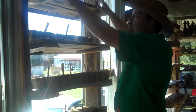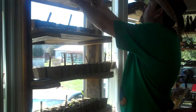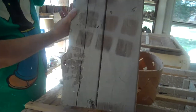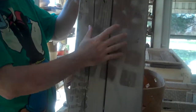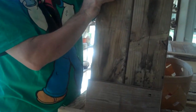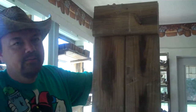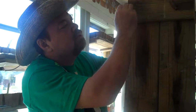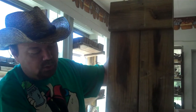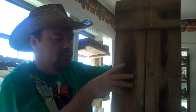All of these supports were put on after we made everything, which is why they fit so well. Excuse some of the dust on the top shelf — what we've got here is two 1x6s cut to the length needed for the window, with two more 1x6s on the back as cross pieces. Toward the end I was splitting these 1x6s to save wood and keep them narrower, but that's really all you need to hold the shelf together.